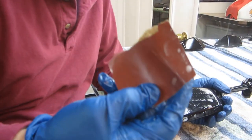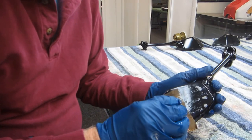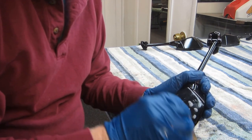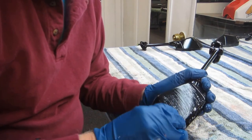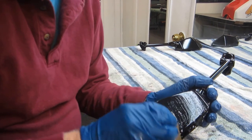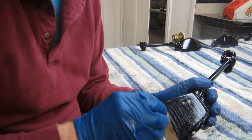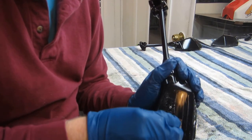A real good trick using this sandpaper - I think it's really the best I've used - as I'm doing one little spot here I'm using my fingertips because this part has a constant curve to it. Your fingertips seem to be the most nimble at doing this. I'm trying to avoid the corners; I don't want to break through on a corner even though this part has a lot of paint on it. With 2000 grit paper that shouldn't happen. As I'm working on this I do one little facet at a time.